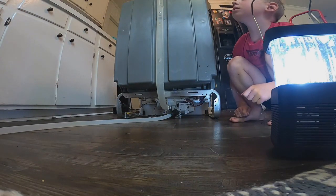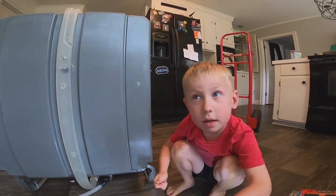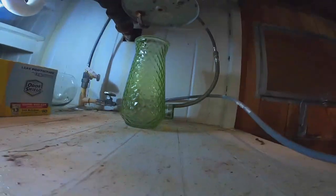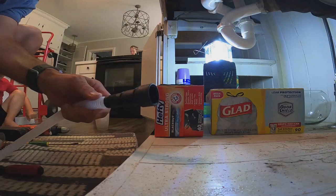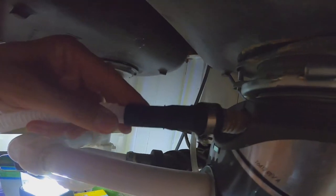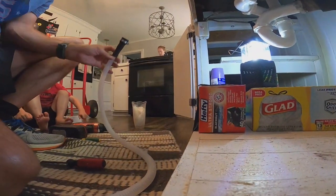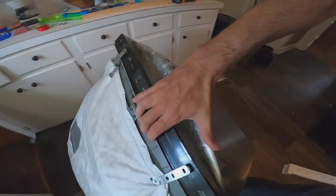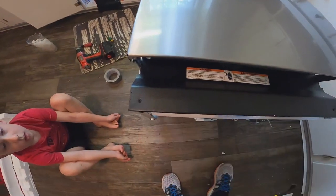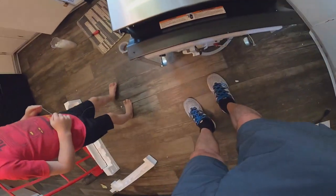The drain line already had some water in it - it dumped a little out. I told you there was water in it. I'm going to see if what I have here will already work. That's the end of the drain plug - it's going to fit over there. Let's see if it's going to fit on top. Yeah, that's going to fit perfectly just like that. One of the things you need to do before you install it - I'm going to lay it on its back - is get this bottom plate off. Phillips screwdriver there, and that should be easy.